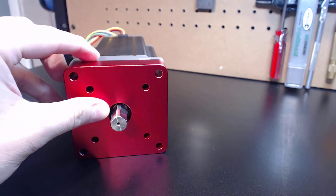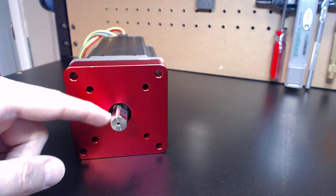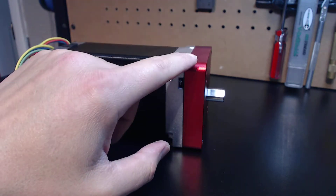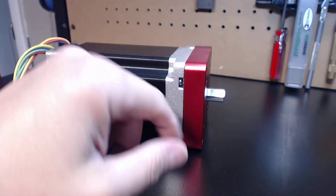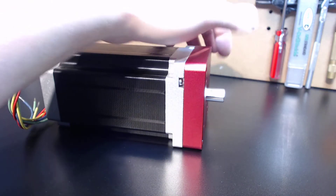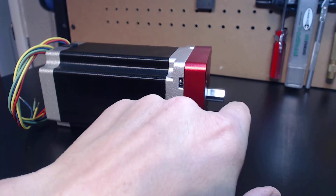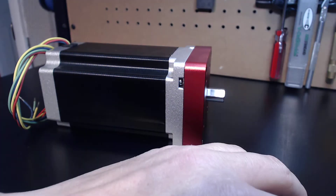If we just come over here and lay it up, it's very simple. You do have 18 millimeters of extension of the shaft before you're into the actual base of the plate. And if you're going to mount these to your chassis, you have a choice, and that choice will always come with the selection of hardware. I naturally can't include hardware standardized for all systems because I don't know what you're using it for. You will have that standoff positioning at three quarters of an inch from the actual machine. So if you bolt this directly, your shaft penetration is going to be about 18 millimeters. As long as you have spacing for your coupler, you'll be fine. If not, you just use the proper length stainless standoff and you're set to go.